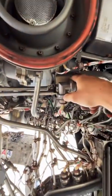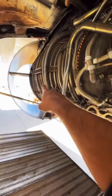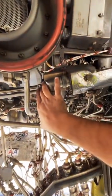This little actuator is very important. It's called the ACC — active clearance control. This rod will move and allow air to go through these ACC tubes. They keep the turbine section at the proper and nominal temperature, so the case expansion or contraction does not exceed limits. It is controlled by fuel. Along with all the harnesses right there is your fire detection system, the fire loop.